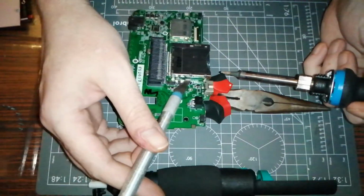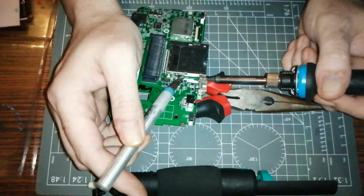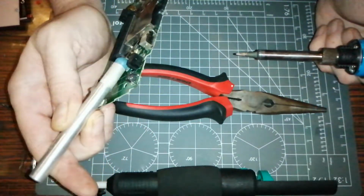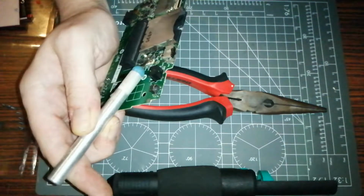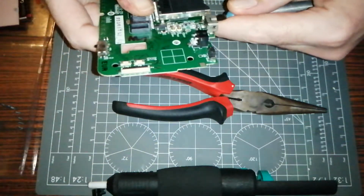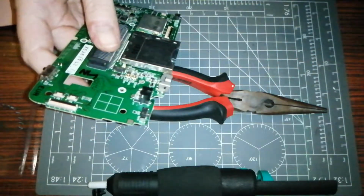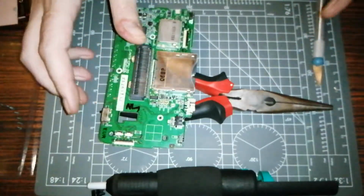Right, so we're prying now because we've sucked off as much of it as we can. So now we're going for this corner first of all, which is a little pull there. Should pry it loose. Yeah, I think that's the trick. Make sure we're separated. What we'll do, go there a second, and I will run the blade. Be careful if you're doing that, especially if you're using a blade. Probably a plastic credit card would be the ideal thing there, but I was just making sure the solder joint was broken without tearing up the pad.